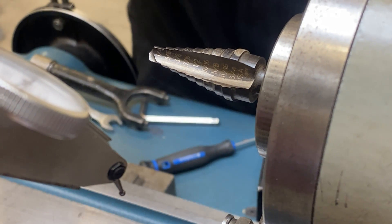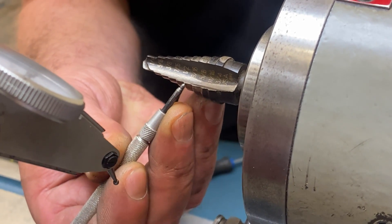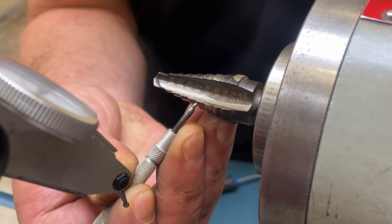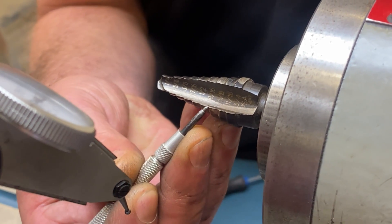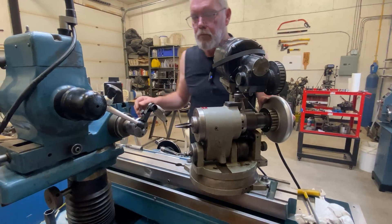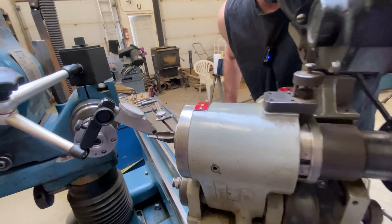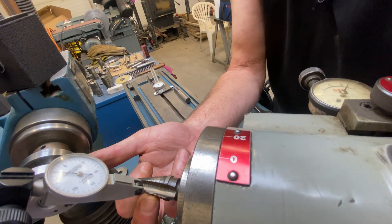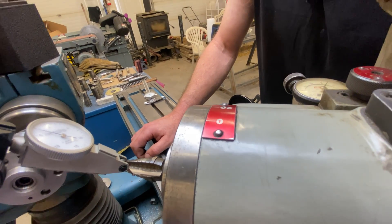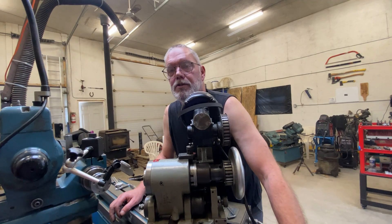My wheel is going to have a flat area to it, and then an angled area — so we're going to be grinding all of each of these surfaces in one shot. I'm running zero on my dial here and I'm exactly at 45 degrees. This stylus is a little on the big side to dial this surface, but it's not crazy critical, and the fact that it's looking good at 45 degrees makes a lot of sense. So we're going to go with that.